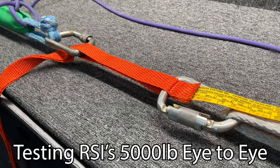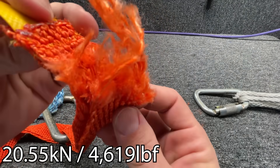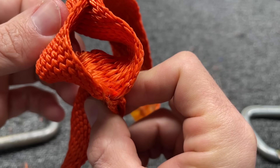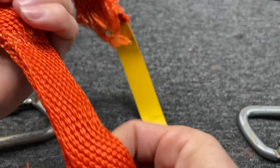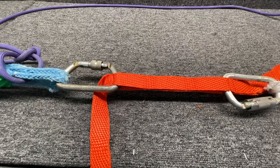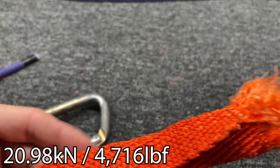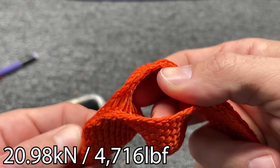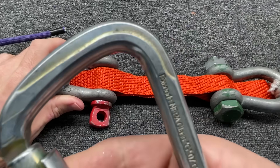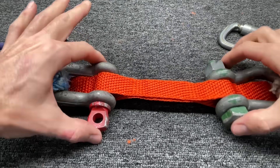You can see here that it ripped the fibers apart where it was pulling against them — it didn't unweave it. This loop here looks undamaged whatsoever, but that loop definitely looks stressed out. I'm not going to pull on that one again — I'll skip it and pull from here to here. You can see how that got pulled apart and how those fibers got stressed out. We'll skip that one again and go to the next one, and pull on these two loops right here. For comparison, we're not going to use a carabiner of that size — we're going to use these larger pins to see if that affects the strength at all.